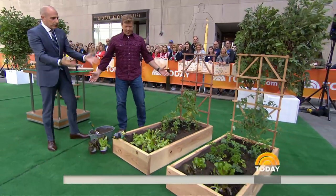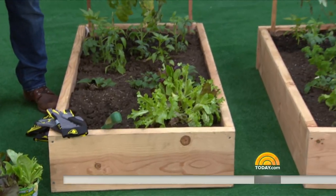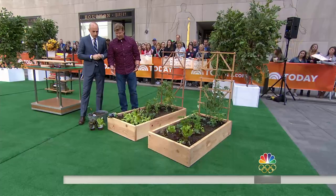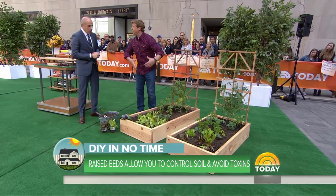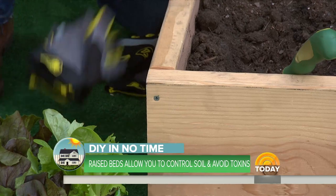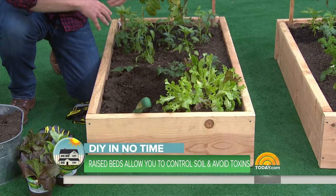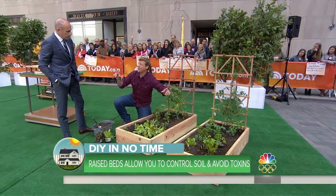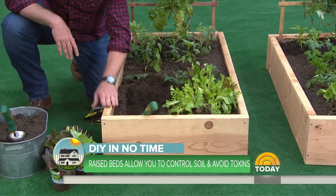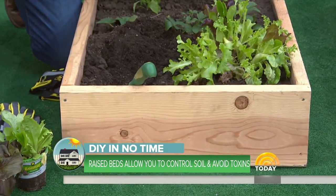Now we've got a weekend project — we're building a raised garden box. We don't want to use pressure-treated wood; that holds up great outside and resists rot, but it's going to have toxins. So in this case we're using fir, two-by-ten. We've simply screwed it together. These are small starters — you can make them as big as you want. You didn't do any fancy joints; you just went end to end and screwed them right into the ends. You can control your soil because you can put in great potting soil in a raised bed. I wouldn't make them too wide because remember, you're going to have to weed them. This will hold up year after year with the moisture — it will last a long time because it's fir. How much is that going to cost as a DIY project?